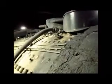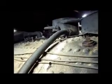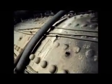Anyway, coming down here is another muffler exhaust. This one's for the blowdown. Basically, we have water treatment on locomotives. Like I said, that we dump in from the back of the tender there, right into the water. And it helps prevent rust and scale buildup inside the boiler.